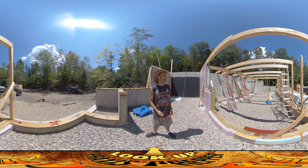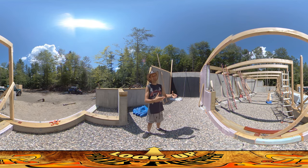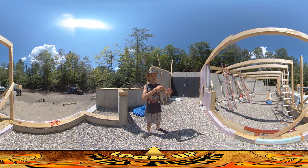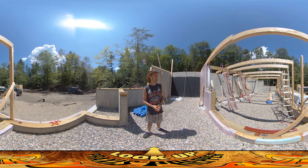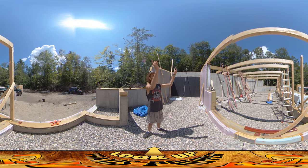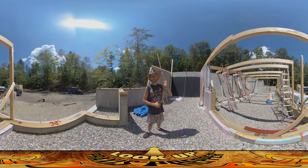If you ever approach a project like this and you jump into it without anticipating that lumber is not always straight, it can be very frustrating. But if you understand this is just part of the process — things aren't always straight and you need techniques for bending them back into shape — you won't feel so depressed when you're in the middle of it. I think we've got a good chance of finishing up. It's only two o'clock, just got a few more floor joists to put up, and then I'll be good to work autonomously and start putting up all this decking. That'll be nice and shady in there, which will be a treat in itself. That's it, thanks for watching.